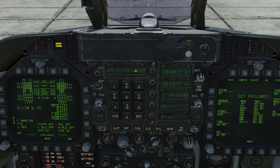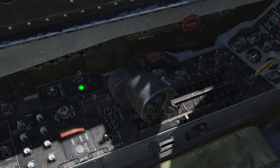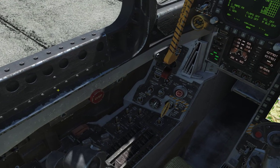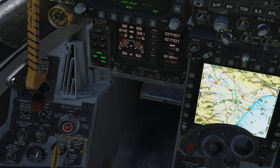Finally, we are going to continue by cranking the left engine. We can see the numbers growing, and at 25% we're going to set the fuel to ON — basically, we're going to feed fuel into the engine. The engine, as usual, spools up.